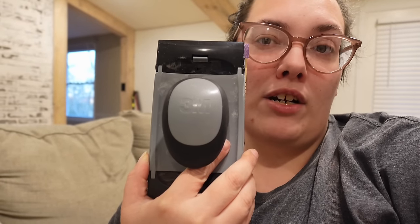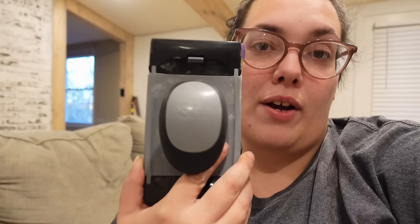I'm using this hand sander — you guys have seen me use this a little bit. I love it for tight areas where I can't get my big motorized sander in and whenever I don't have a whole lot to sand. I just put a new piece of sandpaper on here — this is the 3M one. I'm going in with this on the areas where I've taken the battens off and then I'll put drywall tape and joint compound. I don't know if it's the professional way, but it's the way I do it and mine turned out really, really good.